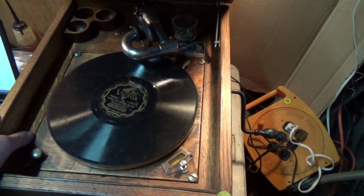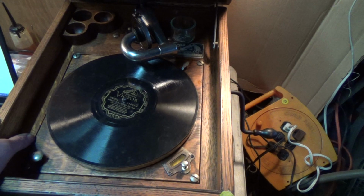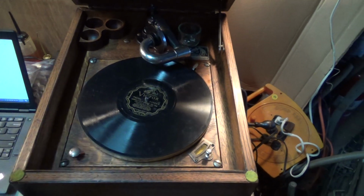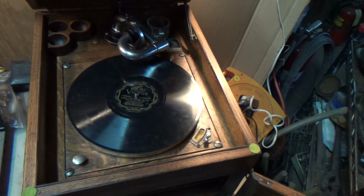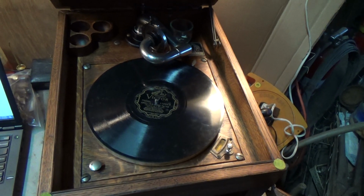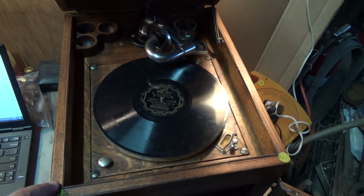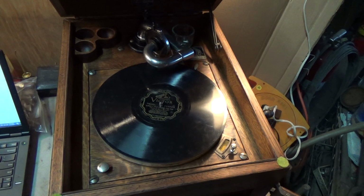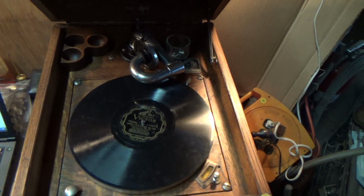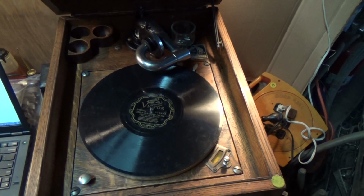This is why you pull out springs and check them. So, of course, I took the motor apart anyway, and I pulled the springs out. Lots of slick grease on there, but I noticed right away it was very, very thick grease. Some of the thickest grease I've ever seen. I have no idea where they got that from. Reminded me of 1950s bearing grease, almost that thick, very fibrous and thick. Not stuck on, not baked on, it wiped right off, but it was so thick, it was actually impeding what turned out to be a brand new set of springs.